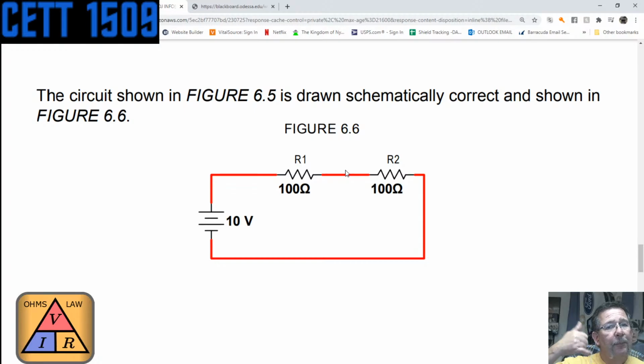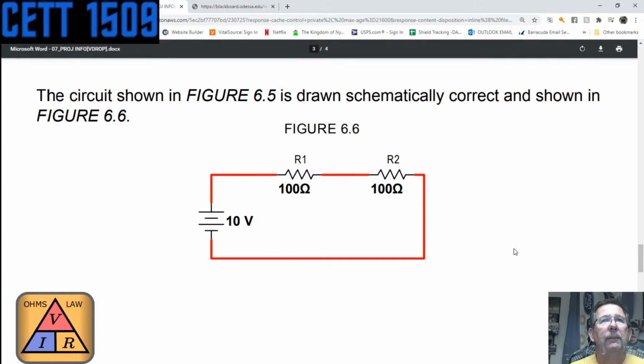Remember we were talking about a hairdryer and the resistance in a hairdryer? Well, what happens there? It heats up, right? So that's a resistor. It just happens to be a heating element, but it's the same thing. It's a resistive element that limits the current. Now, in that case, it doesn't limit it a lot, so there's a lot of current flowing. Therefore, there's a lot of power. Remember, power is PIE. Power is equal to current times voltage. So the more current we have, the more power we're going to have also. Just a little side note.